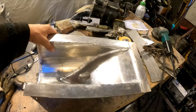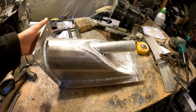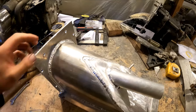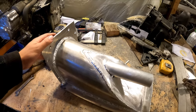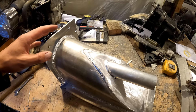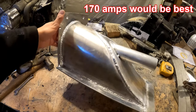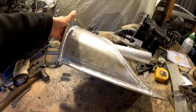Yesterday I got this mostly welded off, but it was a struggle because the welder kept tripping out. Welding at about 160 amps was tripping it, so I had to back off to 150 amps — even then it was still tripping out the power and it wasn't quite enough heat to weld it. So I'm up early this morning, going to give it a quick heat up and then start welding now with no other power going.